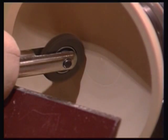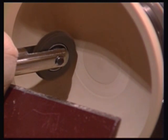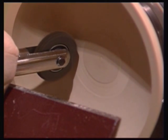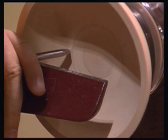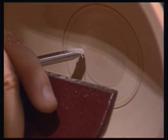As well as creating a wide range of textures to the exterior of bowl work, the tool can be used to enhance platters, either by texturing the rim or by creating a rosette feature in the centre. A micro skew chisel is used to create V cuts to define the start and end of the texture area.